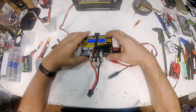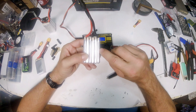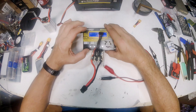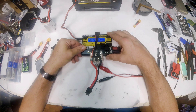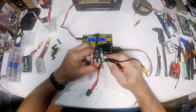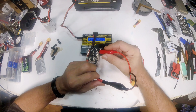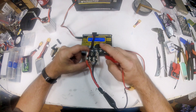Now I need to determine which two cells are bad. I hook up this contraption and switch the charger over from battery meter to battery resistance. I plug the negative in and poke the positive into the first cell and hit start — it says 'no battery found,' so I know this cell is bad. I'll check the other suspected cell the same way — again, 'no battery found.' Let me double-check one of the middle cells to confirm — it shows 28 milliohms, so that one's good.